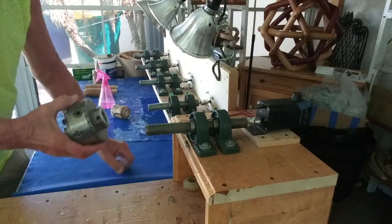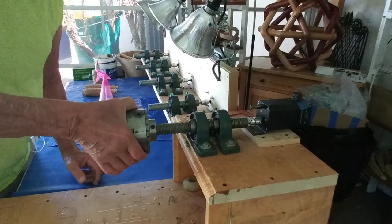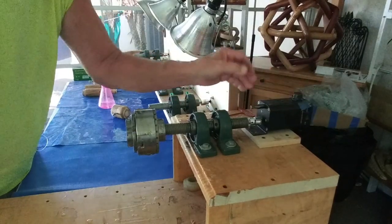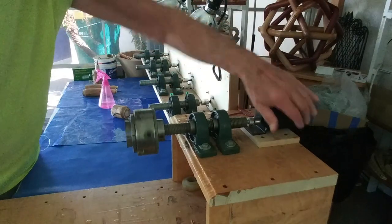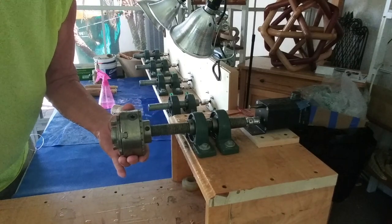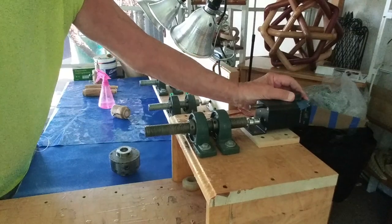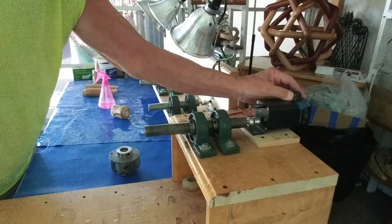So what I do, mostly when I do that, is use this little turner here, and you turn it on, and you can turn the speed right up. And there you are, it's on. And then to take it off, you just reverse it, which I didn't mention, this motor is also reversible. So you can do that. It makes it quick to get off. And then if you've just got it on there, you just slow the speed down to 7 to 10 RPM. I have a little mark on the head here that tells me about where I want it for epoxy.